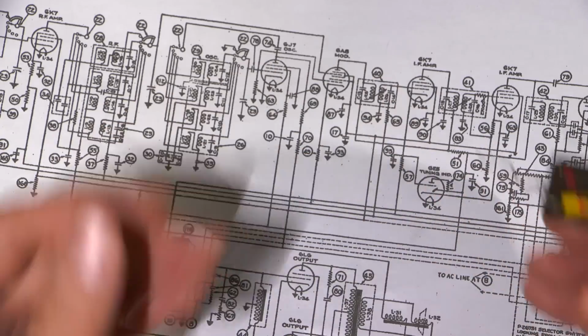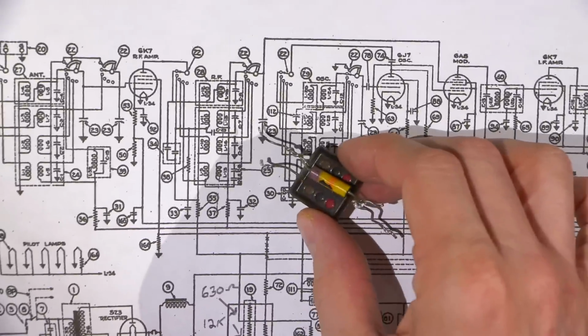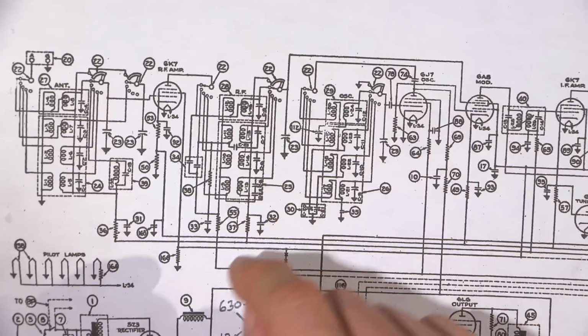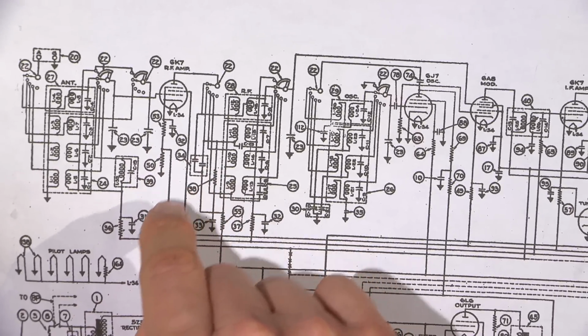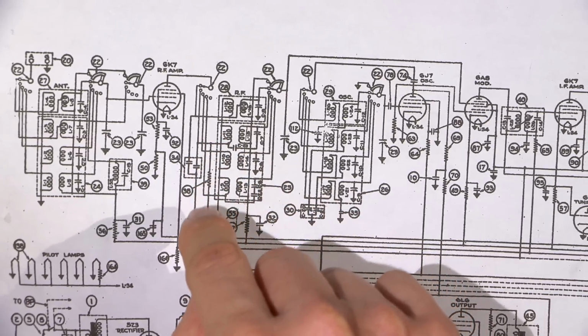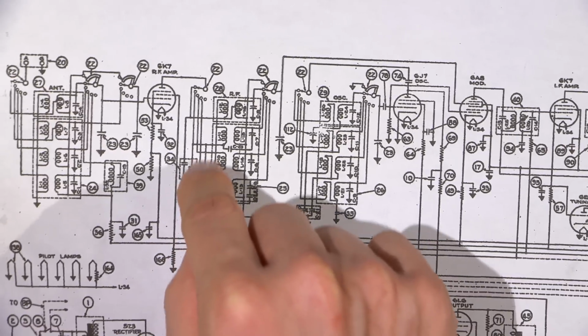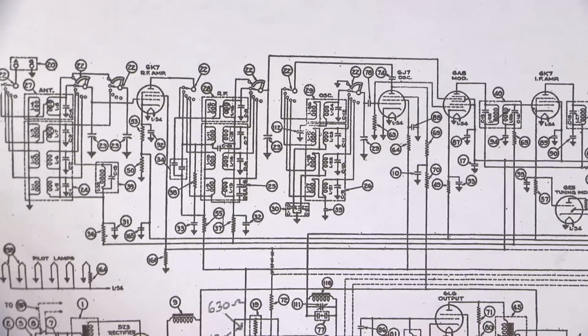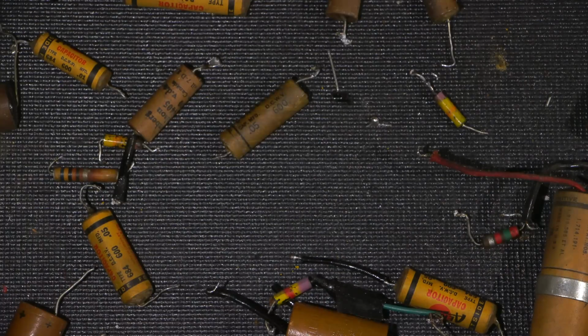And yeah, all of these mica molds here seem to be creating a bit of an issue. So this one capacitor here was in the RF section somewhere. Where was it again? It was this one here. And then there's a resistor across one of these right here. You can see this resistor goes right across this one. So this was replaced with newer mica capacitors, right?